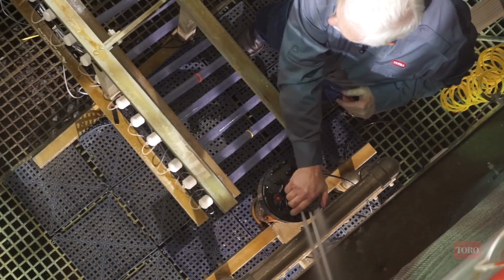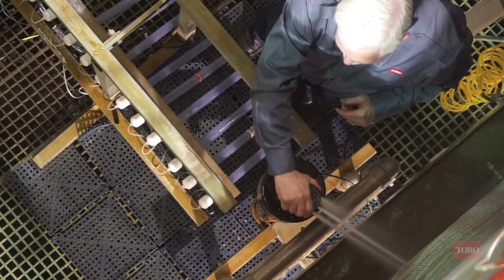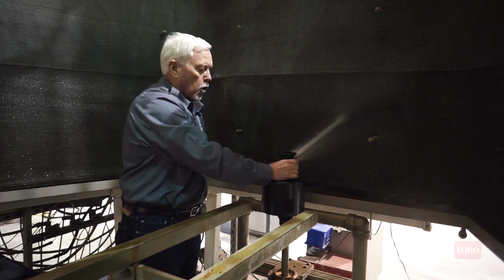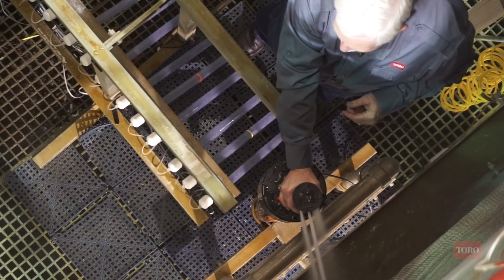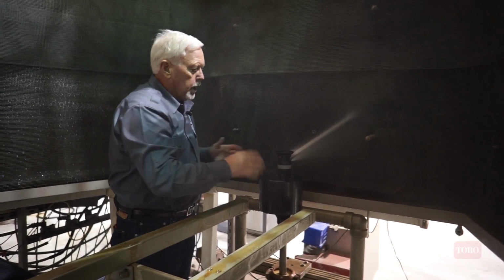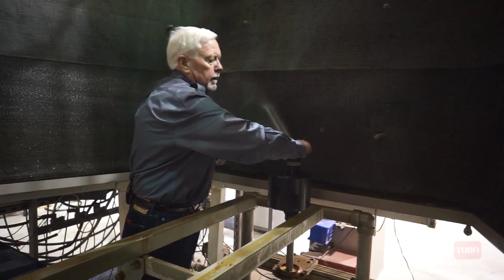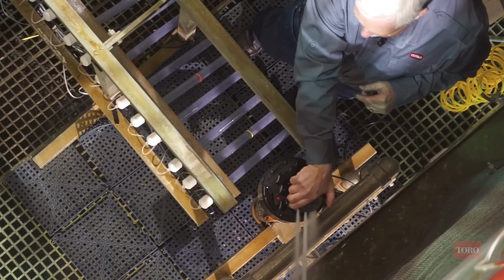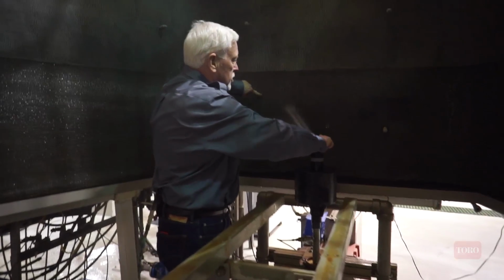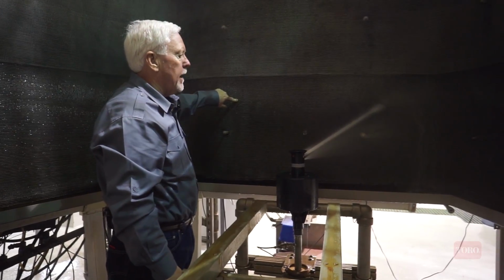Now with the Toro sprinklers, we also have a feature called nozzle base clutching that allows me to move this in either direction regardless of the direction it's turning, or I can also hold it to do hot spot watering without having to drag out a hose and find a quick coupler. But what we really want to look at here is being able to move side to side, see the arc position, and if you visualize where this is at, there is the left position. The right position is just above that bolt.